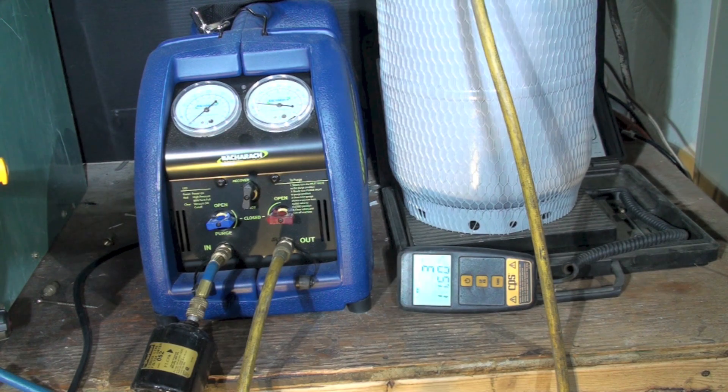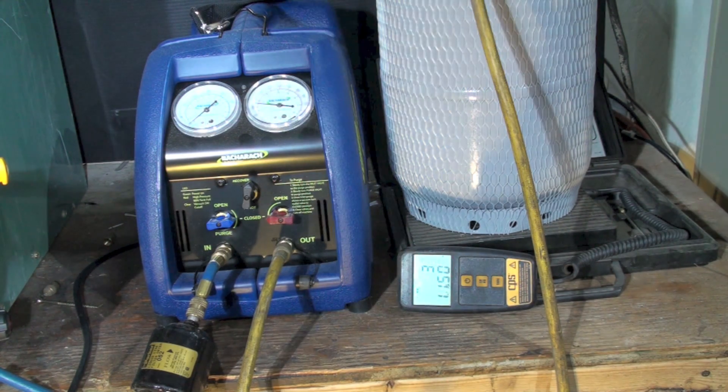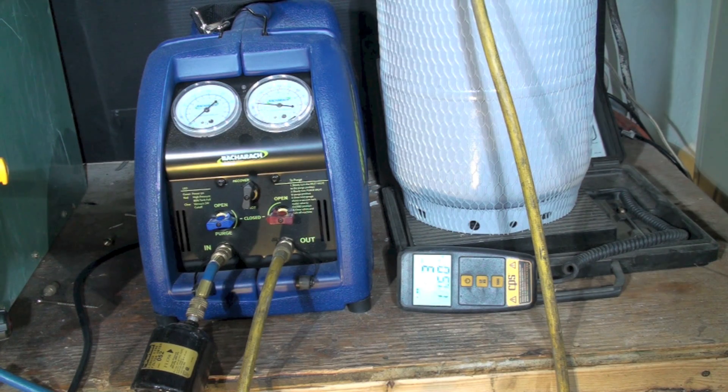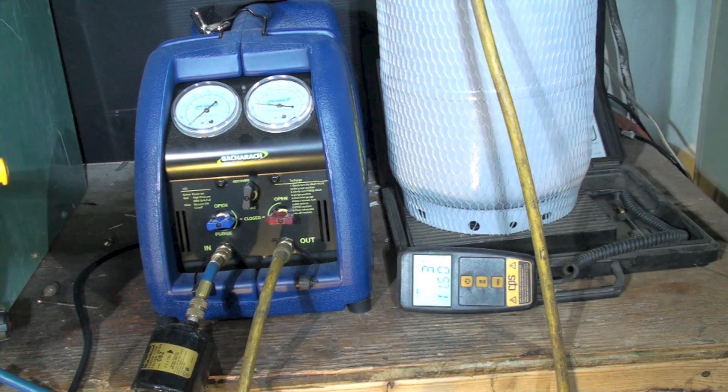The value of using a scale is obvious — you know exactly what charge was in the unit. Did it fail because it was overcharged or undercharged? You know exactly what was going on. If there are leaks to address, you have a baseline to work from. I constantly record this data when working on systems. I'll also put out a couple more videos on this — faster ways to get started and tips for the process.